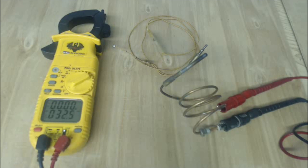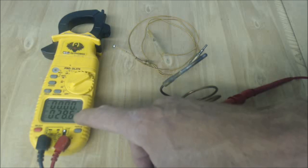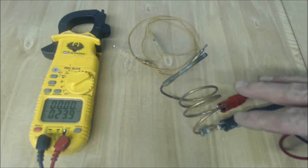Alright, so as we heated that up, it created the DC millivolts. Right in front here you see MV — you have an M right in front of the V, that's millivolts, and we are in DC voltage. So that's how you measure.